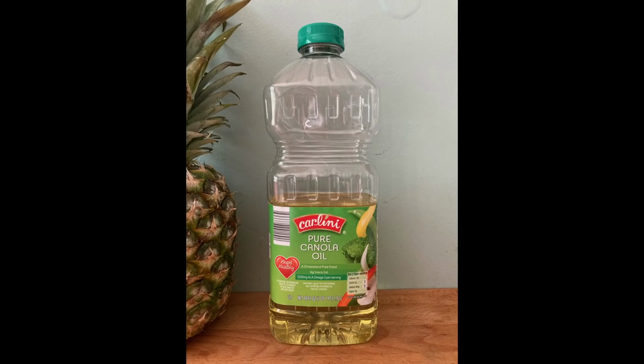So that was one of the big questions going into this study, is just how fast is canola and how would it do in a nickel ball test? I did some searching through the literature on nickel ball results on canola. I found nothing. Some studies did look at canola, but never for the nickel ball test. I think the reason is that the nickel ball test is just outdated at this point. More commonly, they'll do what's called the Inconel probe test instead.